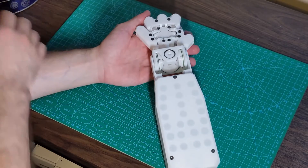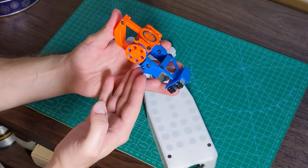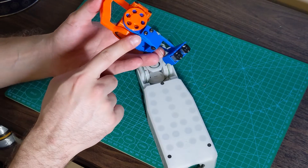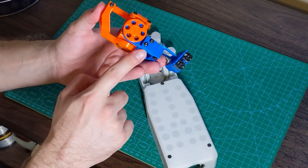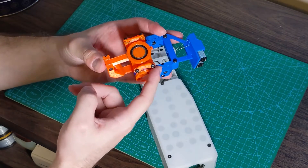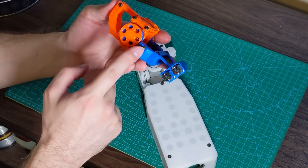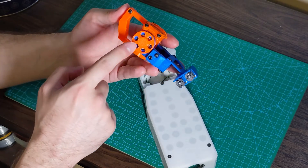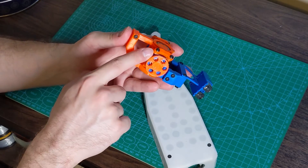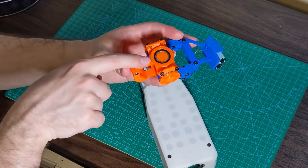To clarify this, let me bring out the prototype version because it has the wires on the outside. For each side of the spindle there is a pair of wires — one goes on the bottom, goes around the spindle, then goes over the guiding bearing and ties on the top spindle. The other wire goes over the top, loops around all the way, then goes over this other guiding bearing, loops around the top spindle and ties on this other side.